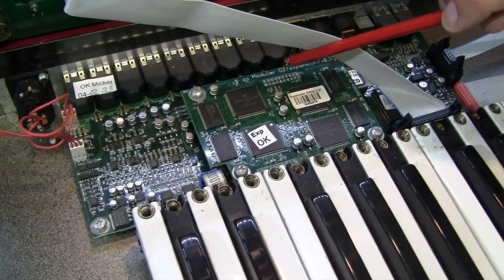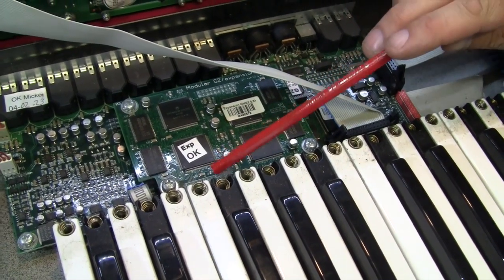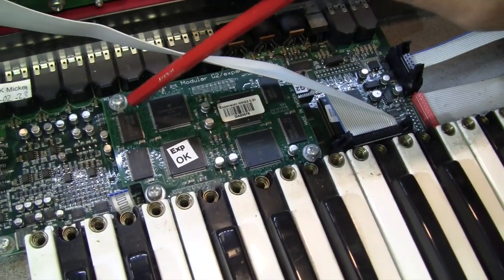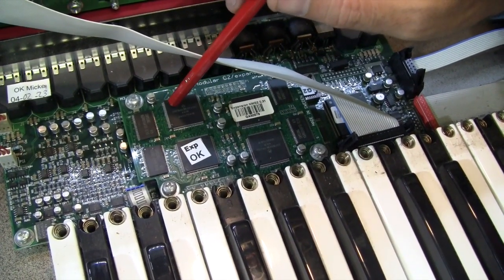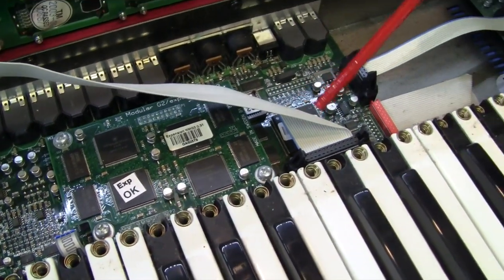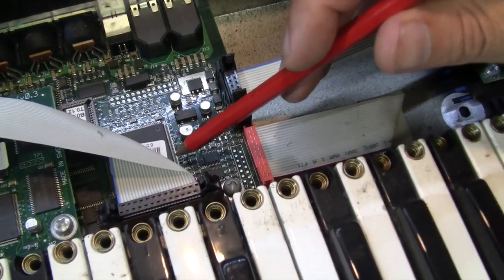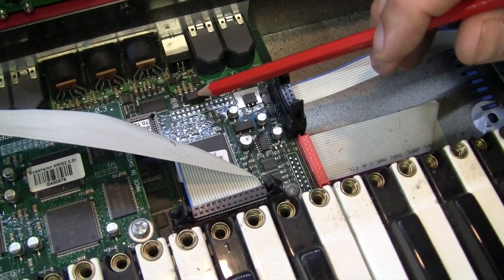Onto the big board here — this is the expansion. This is the Modular G2 expansion. It looks like you buy this and plug it down onto the board, and there's another copy of this underneath the board — it just looks like an expansion module. There's a bit of Samsung memory on there and Motorola DSP chips — DSP 56367V150 — 150 megahertz DSP processors. Very nice. Then there's a main chip here but it's got labels and stickers on it and I don't want to go peeling this stuff up. There's a tiny little bodge wire there — hey look, a bodge wire! A little crystal here, looks like it's 10 megahertz.